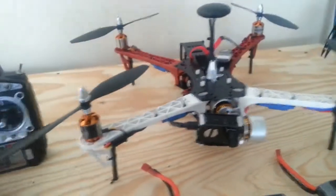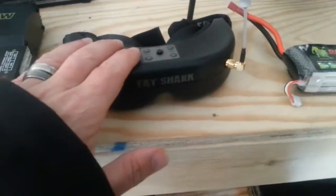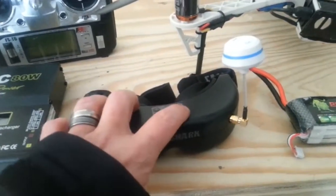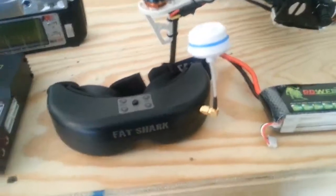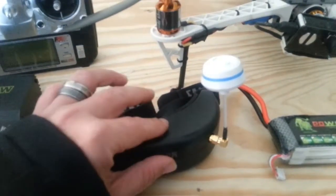The video then comes to you via the Fat Shark Goggles. These have a built-in receiver on them. There's a channel button with eight channels. The way you know which channel to go to is when everything's plugged up — you just hit the up or down button until you see an image, and that's the channel you stay on. If you don't change the channel it'll stay there, so just leave these buttons alone.